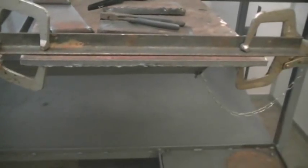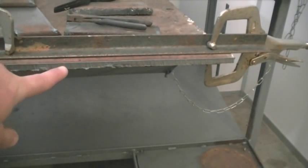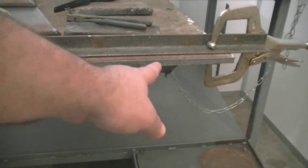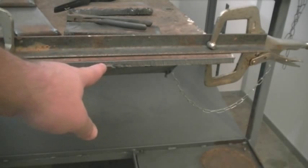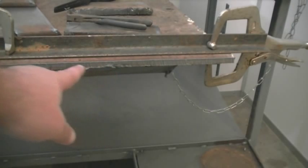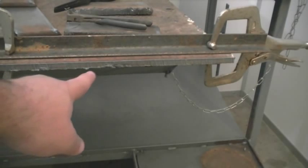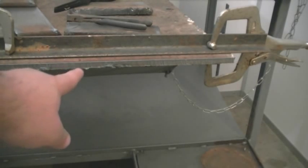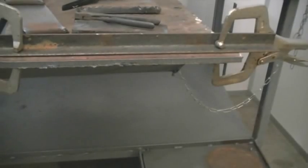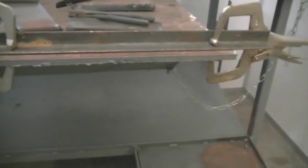See the striations — you can see the lines of the cut. You can see how straight down the lines are right here. They're moving back toward the rear angle of the cut, and that's normal. The thicker the metal you get, the more pronounced that drag is going to be. Those drag lines are going to be sweeping toward the rear more and more the thicker the metal. Or if you're using too low of amperage, you'll see a lot of drag lines running toward the rear. But you can see it's a very clean, very straight cut — nothing wrong with it. It's ideal.